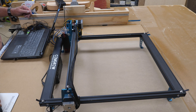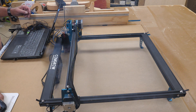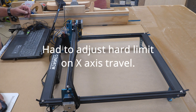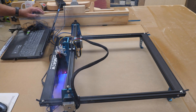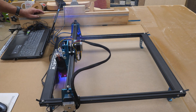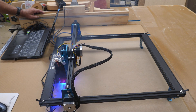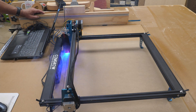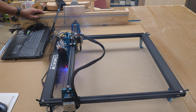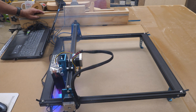So I just need to hit start. Now if something should go awry, there is a machine alarm. Normally I would do this in two passes, but because this is a 10-watt laser, it's burning a nice black line. The total engrave on this is almost two hours and 50 minutes — it was telling me two and a half hours. So we'll let it go here and check back on this from time to time.